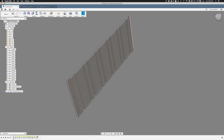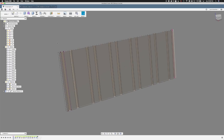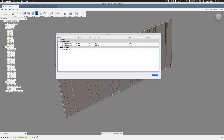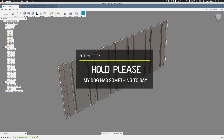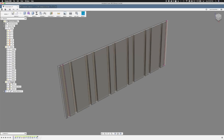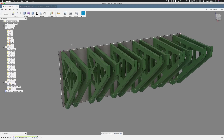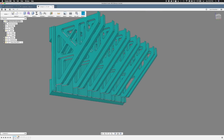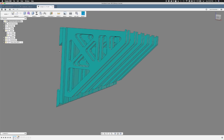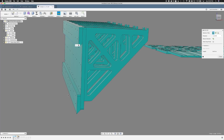If we turn off all these bodies, you can see what we've cut out. Instead of worrying about material tolerance within the model, we just made our ply 0.7 and we don't worry about how those fit into the dados right now. We'll worry about those when we get to stock to leave in CAM, and deal with an offset tolerance there that works really well. Here's how we've taken the model and extended it down a little bit so we could fit it into our shop's French cleat setup, which is 12 inches apart — so it's just a little bit longer than what we saw before.